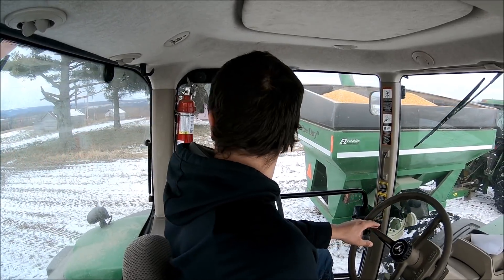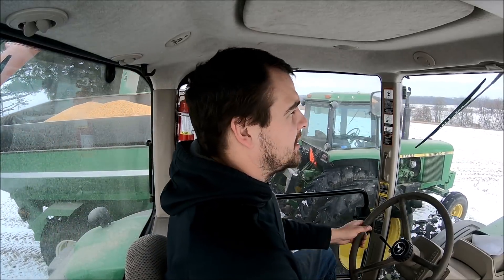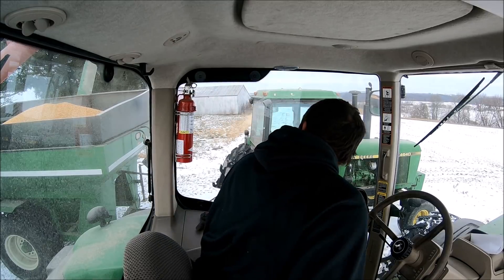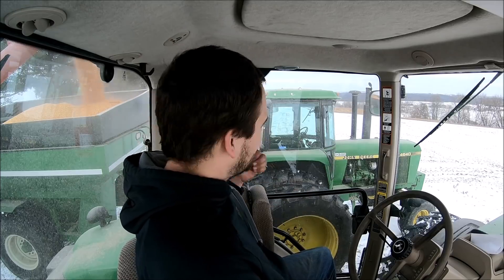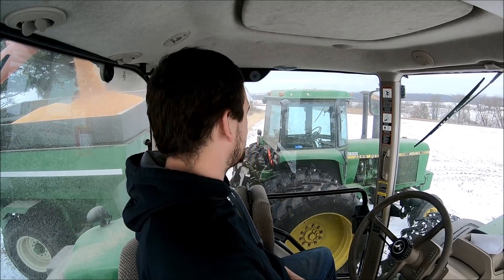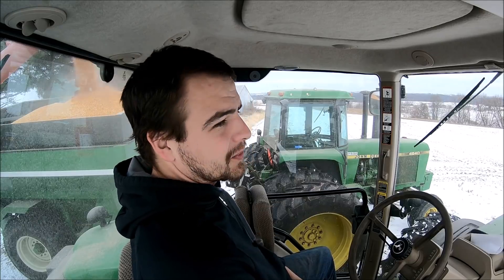So I don't have Ryan here — Ryan's preoccupied right now. And this is actually what I prefer to do. I'm tendering to this green cart because the 4640, when I first brought it up here this morning, it was doing some digging with no load on it. It kind of surprised me — I really thought it could hold the snow a little bit better. Pulling that cart empty uphill, it was digging with the rear tires, and the front tires wanted to skid more than actually turn. So I just felt it was best to park this up on the level where we're loading the semis.